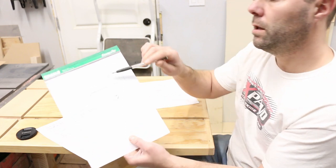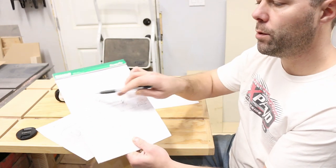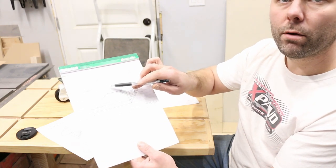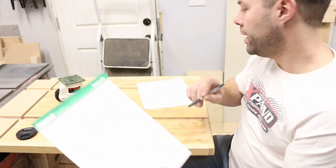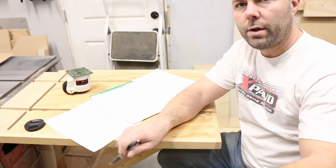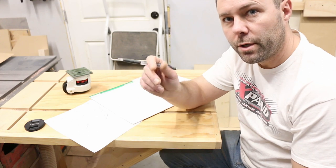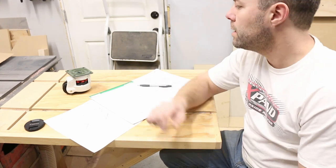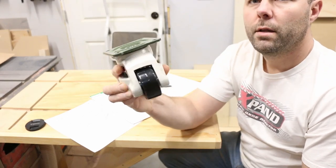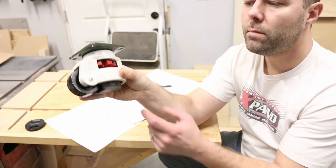It'll be sort of four posts with cross pieces, and we'll use lag bolts from underneath up into the table top in case I ever want to change it. We'll put two drawer cabinets in here as well later. For the casters, I'm doing something different — this table saw is sitting on an open torsion box base with six casters and toggle clamps. For this workbench I found casters online, bigger ones at about 700 pounds per caster.